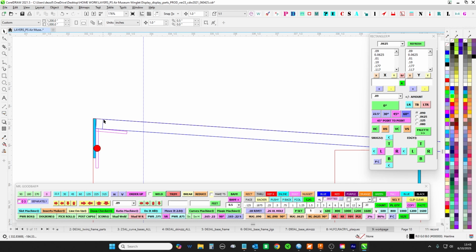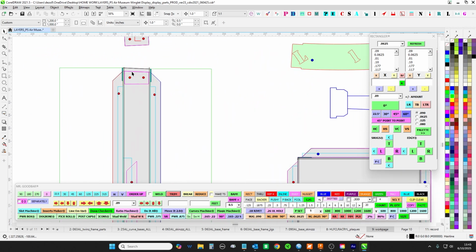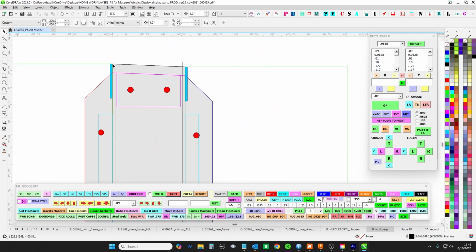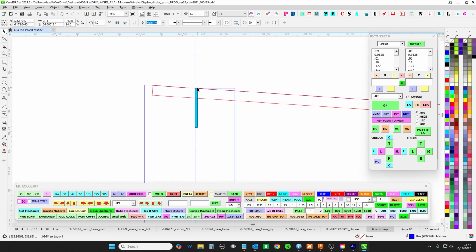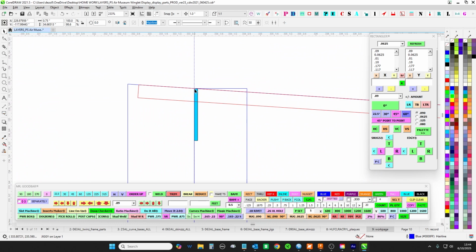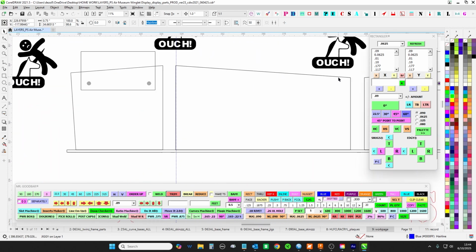But where this one hits is over here, and it's more like 34 7/8, which is why you get this slant. So your highest point on the face, which is red, and you can see where I color coded that red, is the highest point, 35. Then you slope down where it connects to the blue side, which is a little bit less, which is confirmed here. So this is where it engages, this whole flat part like that.